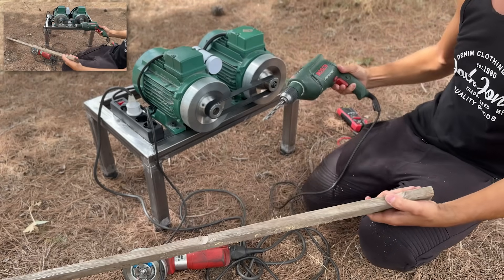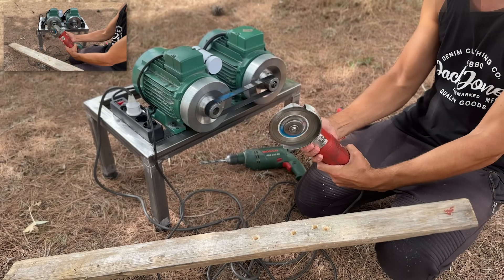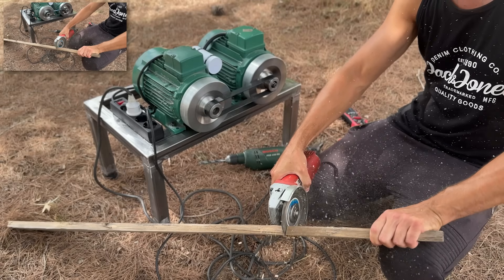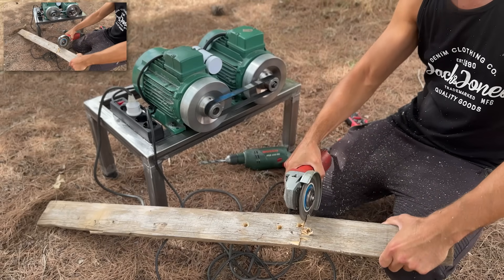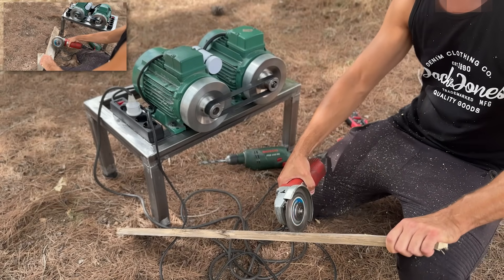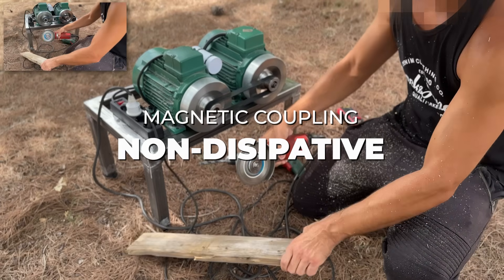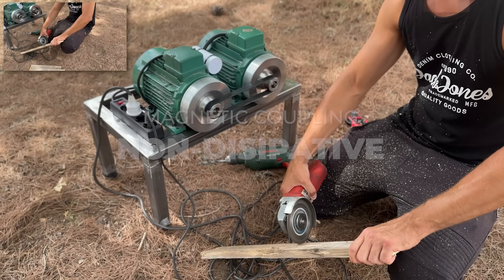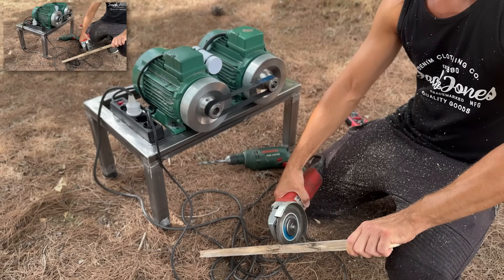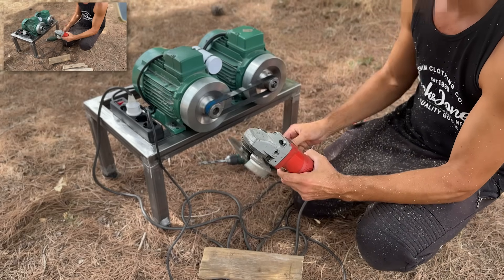When neodymium permanent magnets rotate in front of this superconducting rotor, they do not induce any currents because there is no resistance. But neither do they generate classical magnetic braking because the magnetic flux is trapped in stationary quantum states, not in induced currents that dissipate energy. In other words, the electromagnetic coupling becomes non-dissipative. The generator continues to produce voltage thanks to the change in magnetic flux, according to Faraday's law, but without any measurable resistive torque on the shaft.